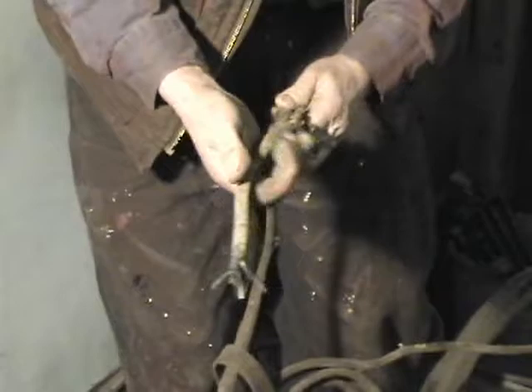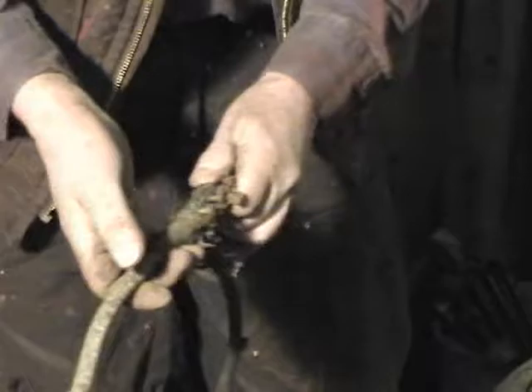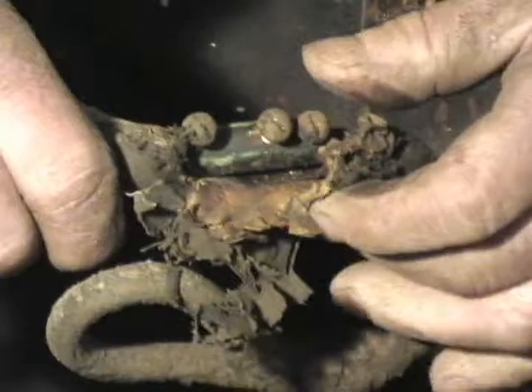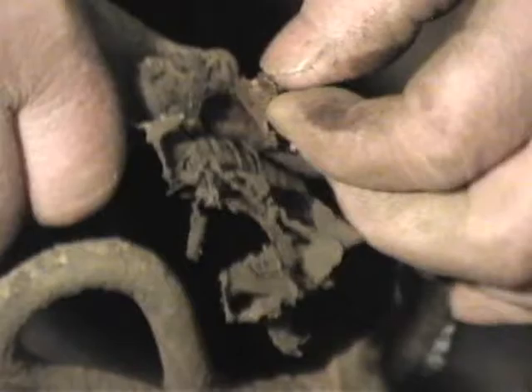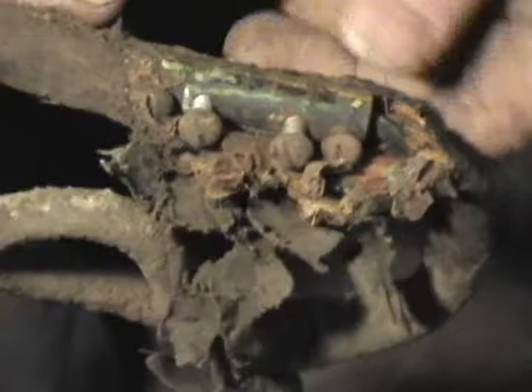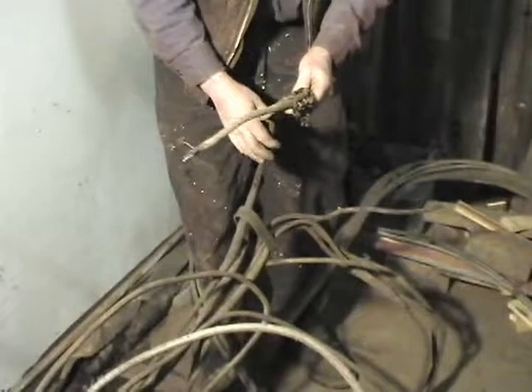This was wrapped with a material called cambric tape, which is a bias tape — woven at a right angle but cut at an angle so it doesn't unravel. There's an inner layer where vinyl tape was used — it doesn't have an adhesive and doesn't wrap evenly easily. Then they either put rubber tape or wrapped it directly with friction tape, which is what you see here. I just peeled this off so we could see the connector — and we'll recycle that connector and use it again.